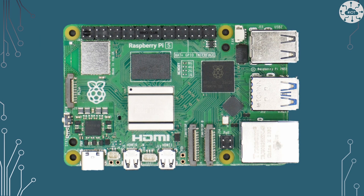The Raspberry Pi 5 comes in the same form factor as usual and so it feels very familiar. We've got the normal GPIO pins, the four USBs and an RJ45 for ethernet. We still have USB-C for power, two mini HDMI ports that are 4K capable, and a power over ethernet option available, though the PoE board isn't out yet for the Raspberry Pi 5. A few things have changed though — we now have two camera or display ports, though they've shrunk to a slightly smaller size, and this has made room for a PCIe interface. I'll use that later to mount an NVMe SSD drive.